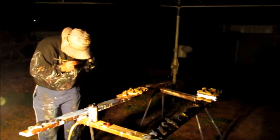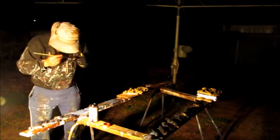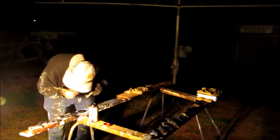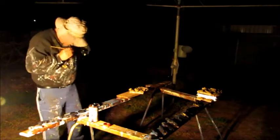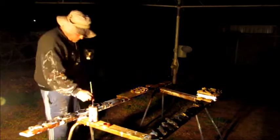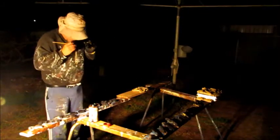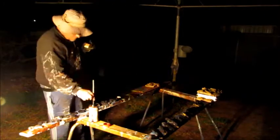Here I'm applying stain — it's a dark mahogany. This is an old trick that any picture framer will use: if you're going to put gold leaf over the top of your frame, you put a stain underneath — or even gold spray paint or bronze — because this will actually help bring depth to the next layers that go over the top. Any picture framer will do this.